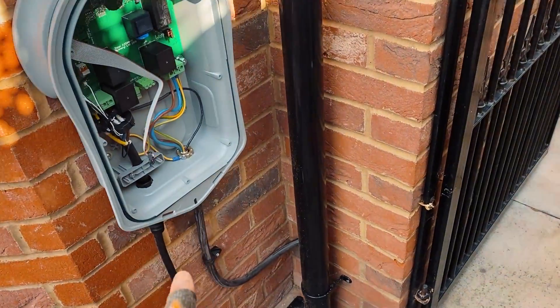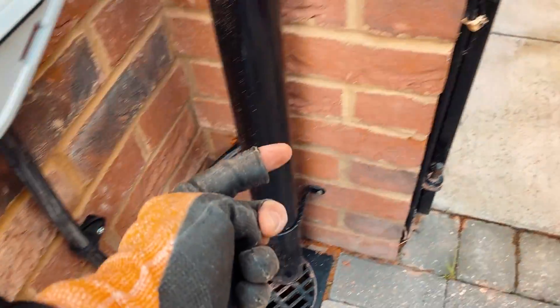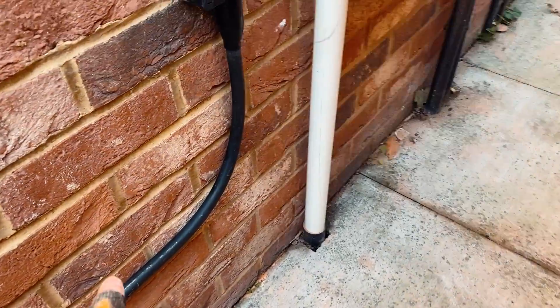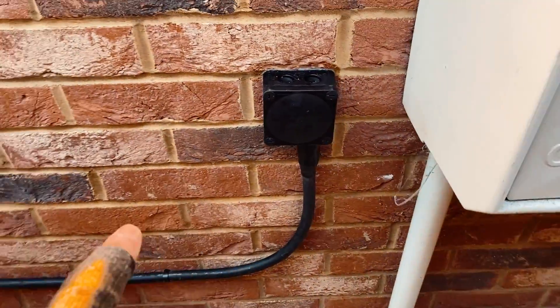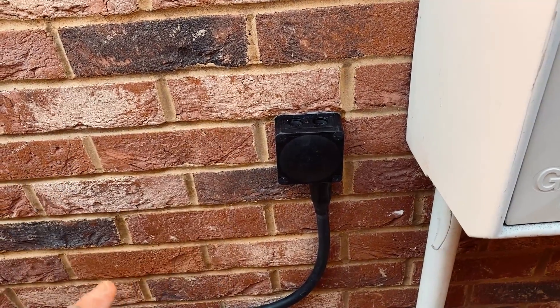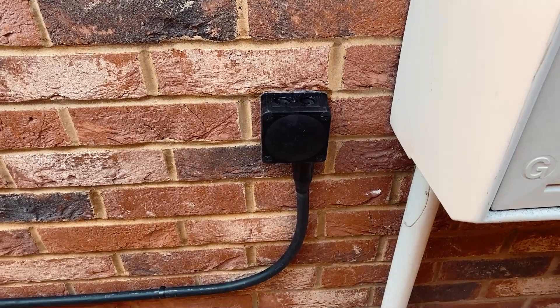The cable is all installed on the outside. From the Zappi I've gone down around in a little bend and through the wall at an angle, come out there, then literally just clipped all the way along with the Linnean super clips — which I absolutely love, they are so neat and discreet — and then into this box. The inner sheath has continued through the hole and comes out the other side in the trunking.